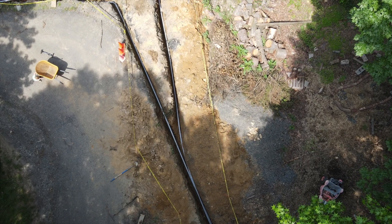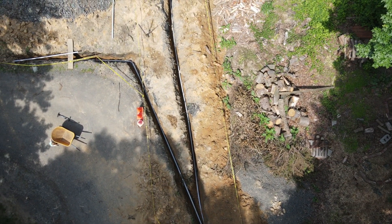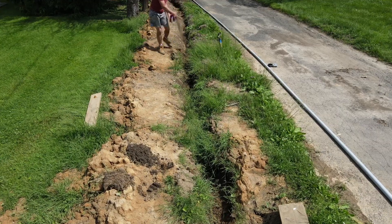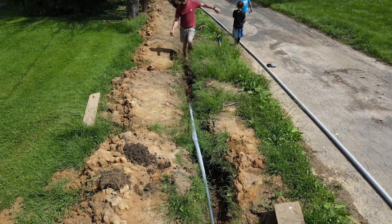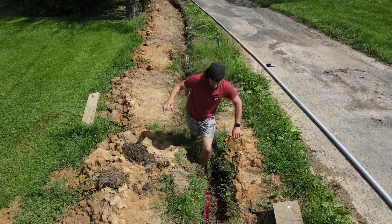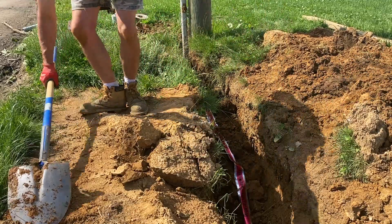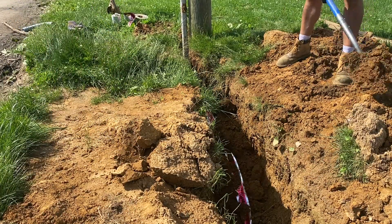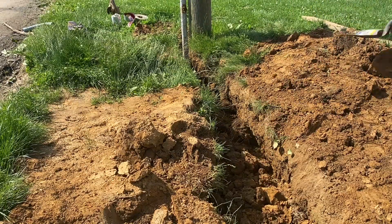You can see my two electrical conduits at the bottom of the hole. The next step is to throw a couple inches of dirt over top, followed by some electrical warning tape — a warning to anyone digging here that they'd hopefully hit that tape first and still have a little buffer before hitting the conduit. Then a couple shovelfuls of dirt on top of the warning tape to make sure it doesn't go anywhere.